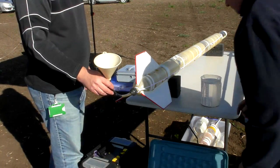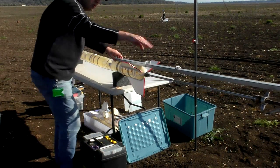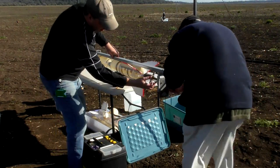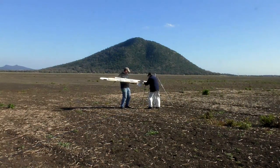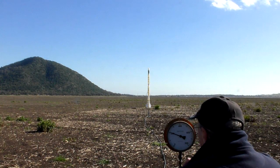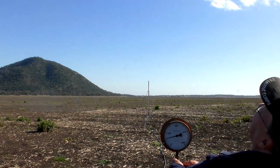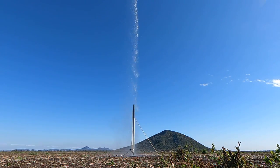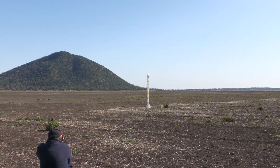The rocket gets filled with 3.8L of plain water. The easiest way to get the rocket onto the launch tube is to do it on the table — this rocket uses a 16mm nozzle. We then carry the whole rocket and launch tube to the launch pad. Okay, let's launch it. We're pressurizing to 210 psi. 3, 2, 1, go! Here's the launch from a couple of different angles. Parachute now would be good.